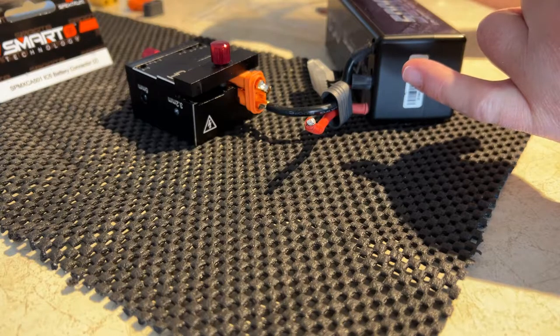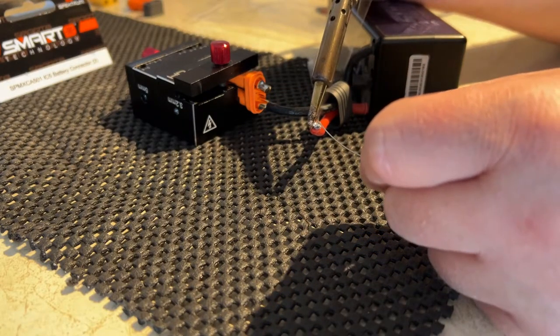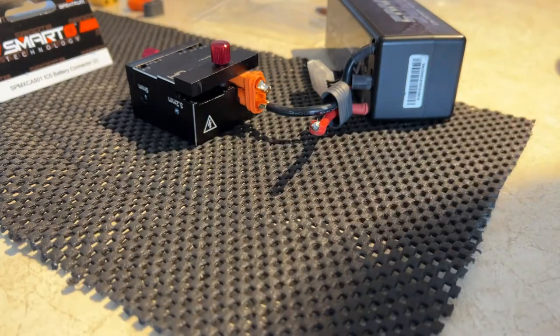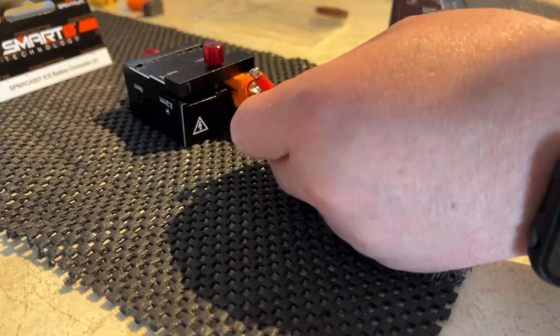If you look at it right now, it changed color — it's a shiny kind of matte. That tells me the solder is basically cold. The solder I'm using is a 60-40, if I remember correctly, with resin core in it. I do not use soldering paste — basically the soldering paste is acid and it will eat your connector. You use soldering paste when your wire is corroded or your connection is bad. In electronics they do use a little bit of paste because it will double your heat, but they make sure to remove it after so it doesn't corrode anything.